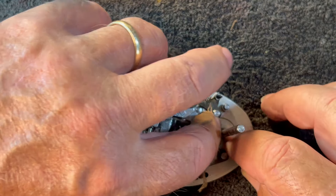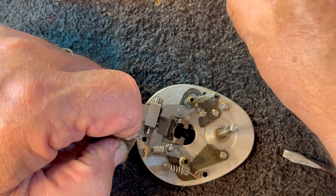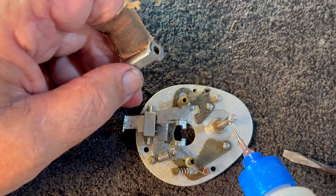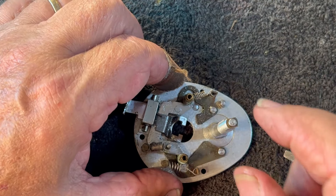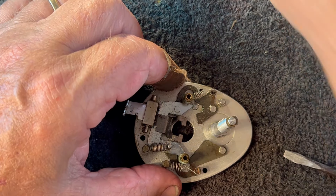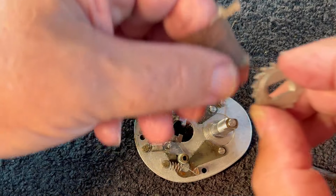We've got this guy all cleaned up now. I went ahead and greased everything while I was cleaning so I've got a little coat of grease on everything, up underneath everything — up in here and up in here — and then we'll activate the trip levers, which deactivates it. We are ready to put this shim washer on. Let's slide that all the way down to the bottom. Now here is where things become a little less happy. We're going to put oil on this shaft — some people grease that, that's okay, but we're going to put oil on simply because when you take this cap off and open it up it opens right here, and oil is the basic thing that belongs in there.